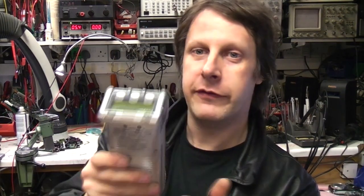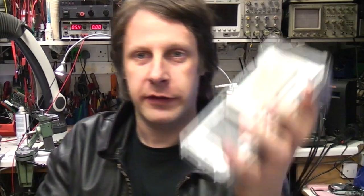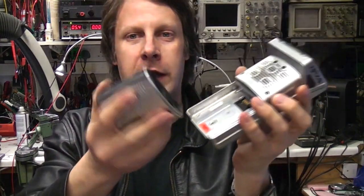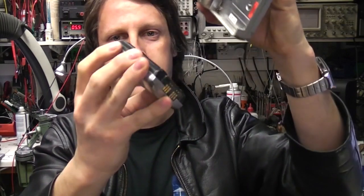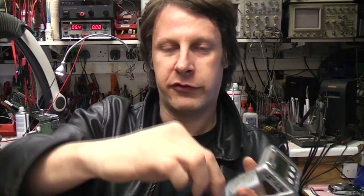One of the other things you notice is the battery pack. One of the things the standard says is you can't remove the battery without the use of a tool, because obviously taking out a battery in a hazardous area could be dangerous. So this has actually got a captive Allen key that you have to unscrew in order to get the battery off. And obviously the battery won't actually latch in until you do up that screw — it's preventing access to these potentially dangerous terminals. If you took that out and shorted it, you'd get a spark and boom — not good.